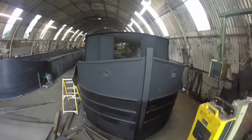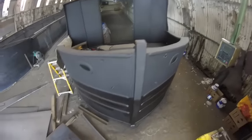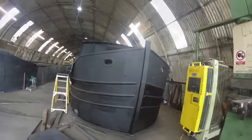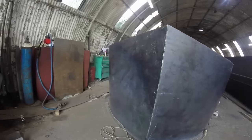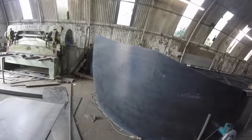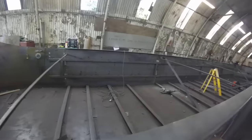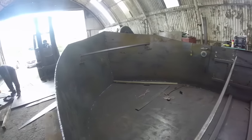Just for anybody wondering, this boat is actually 62 by 10 foot. The boats are fabricated from sheet steel — if my memory serves me correctly, it's 10mm on the bottom, six millimetre sides up to the gunwale, and I think five millimetre sides and roof.